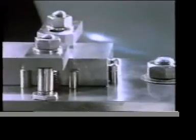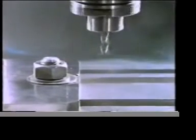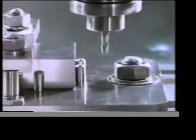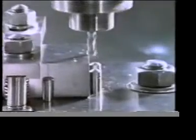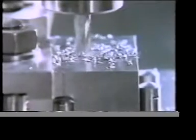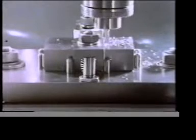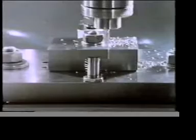We've mounted this component on a milling machine — let's take a cut. In this operation the cutting forces acting on the component are relatively small. In fact, the forces are so small that the metal dowels aren't really necessary, so let's do away with them. Now in two directions we're relying on a frictional restraint obtained from clamping forces.